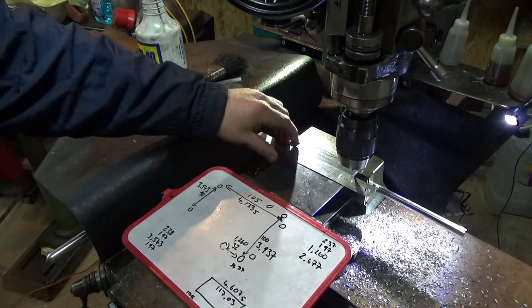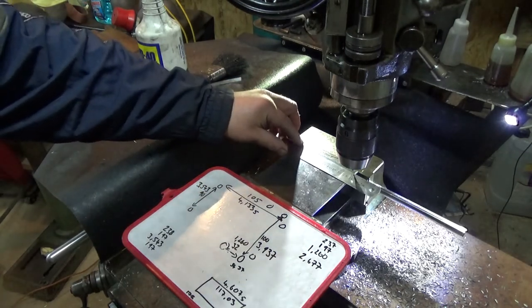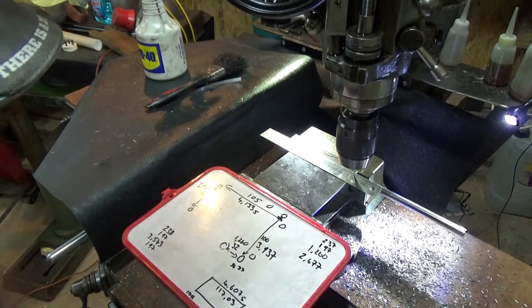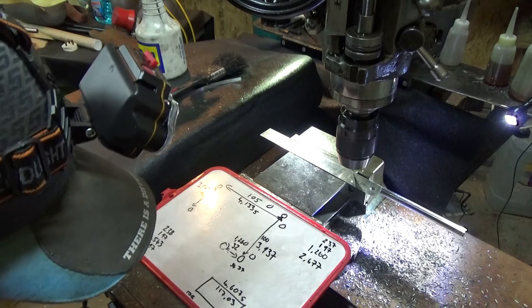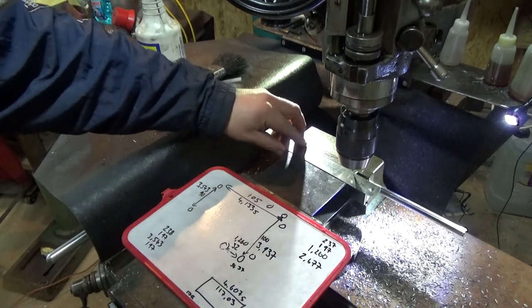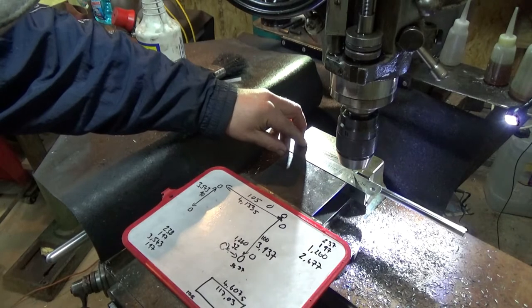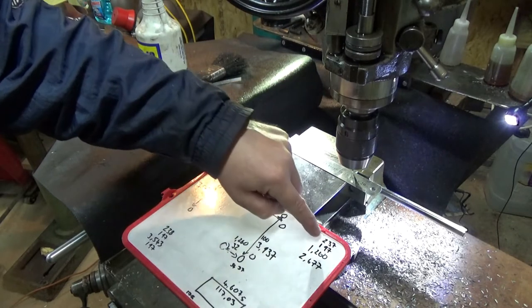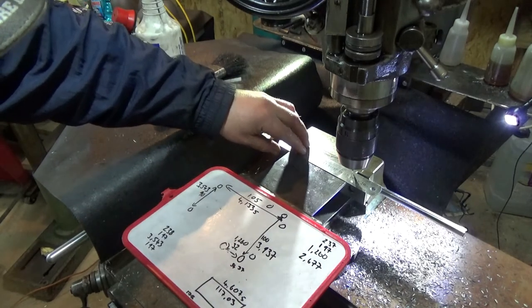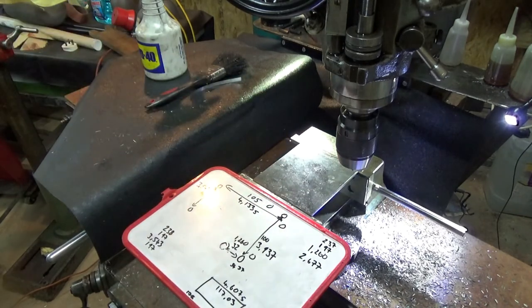And that should be 5 millimeters in from the end. And it looks around about 5 millimeters in from the end. Just looks a bit more than five. It should be 6 millimeters in from the end, sorry. 6 millimeters. 6.0 something, whatever 237 is. Or actually 238 on this one. That should be 238 thousandths in, which is about 6 mil.